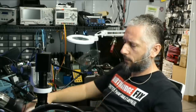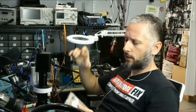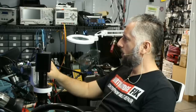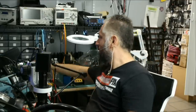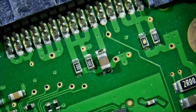Let's see what's going on. We have the hard drive right here, and the motherboard right here. Let's take a look at the board and see why the hard drive is not spinning, why it's not being detected, and all that stuff. The customer cares about the data, and right off the bat I see something wrong — a zero-ohm resistor on the right side. Looks blown.